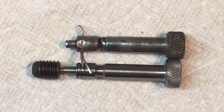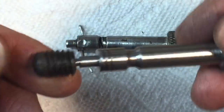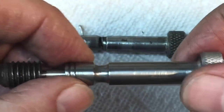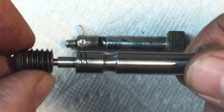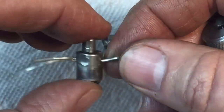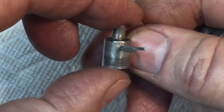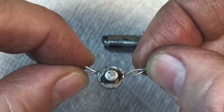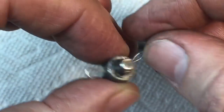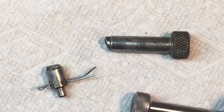We're pretty much close to finished, and you can see they match up. I left it like this to show you how the bolt is still on there — there are little rings where the threads were. I wish I had more shank on that bolt, but that's no problem; it's just this top pin area that really matters. Here's the one dilemma: we've got to drill out this hole, but it's not exactly centered — it's off to one side. It looks like they almost tried to bypass the center, or it could have been a factory mistake. But I have to duplicate that.